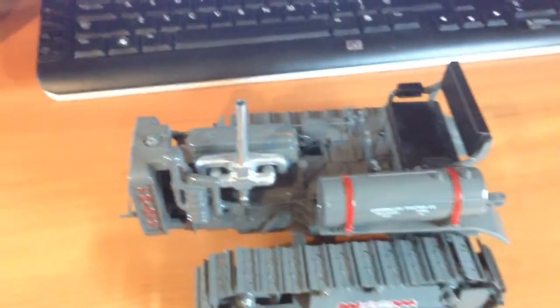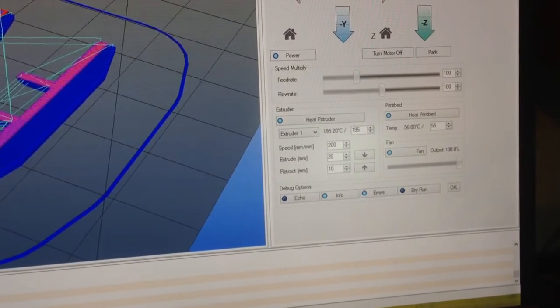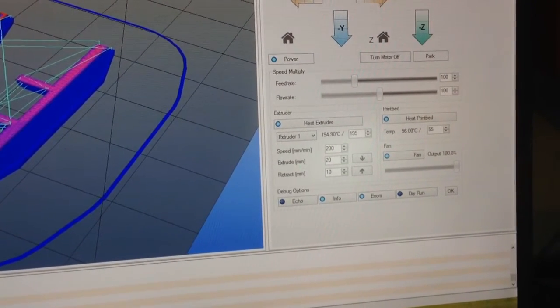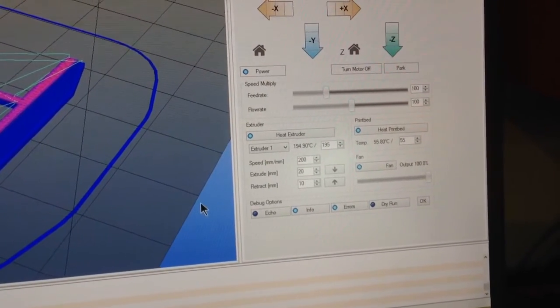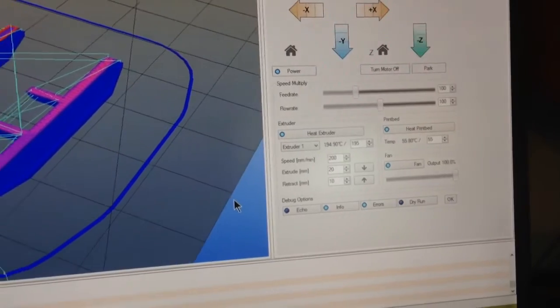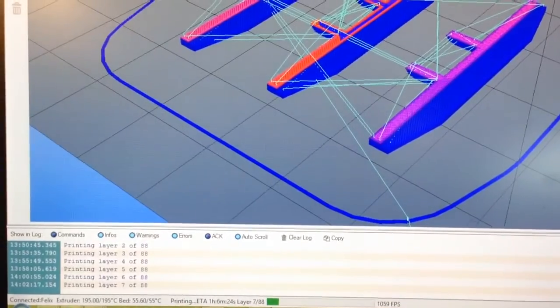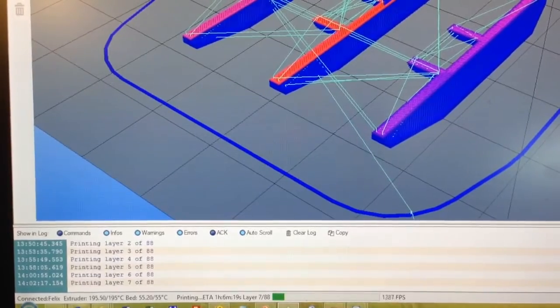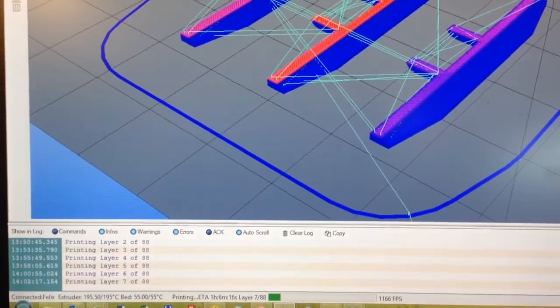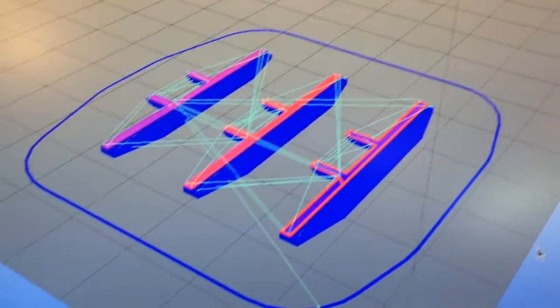We are moving along here. Currently printing at 195 degrees Celsius and the print bed is heated — if you've seen some of my videos in the past, you'd know I normally point out this information. We are at 55.8 degrees Celsius on the bed, which wavers just a little bit during the print. Each one of these links is at layer seven of 88 total, and we have one hour and six minutes to finish these three prints.